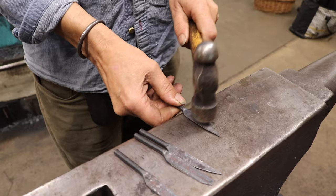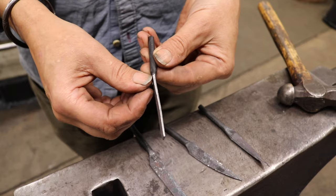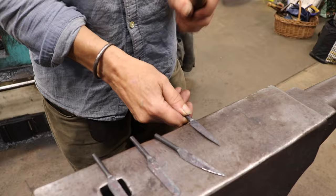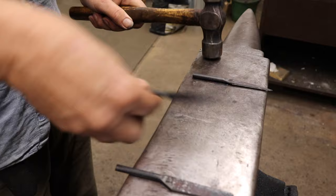And then sometimes the shearing action, if I'm shearing too close to the spine, it can offset the spine a bit, and I need to hit quite accurately in here. But to start off with, I'll just take this obvious bend out. If you carry on hitting, it will straighten and then over-straighten. But it's just a few light, gentle taps with a bit of downwards pressure. So I'm pressing down here. That's straight enough. Again, hump up.